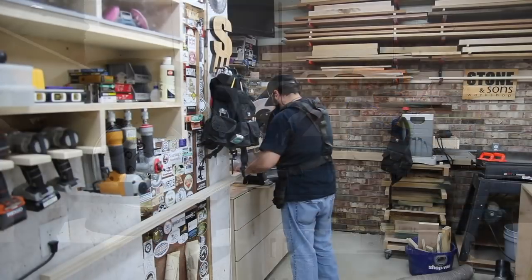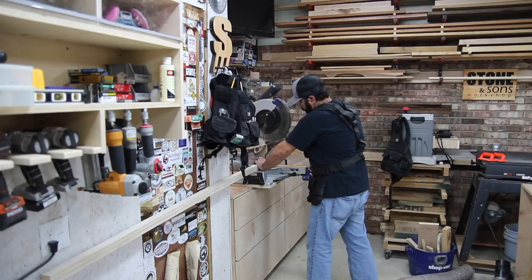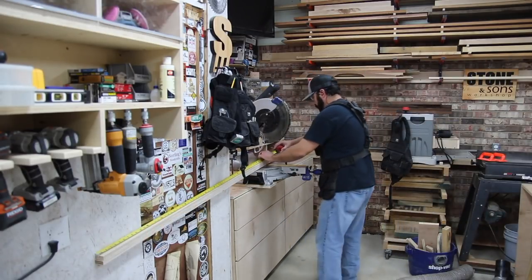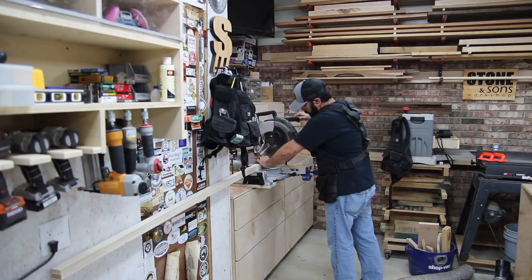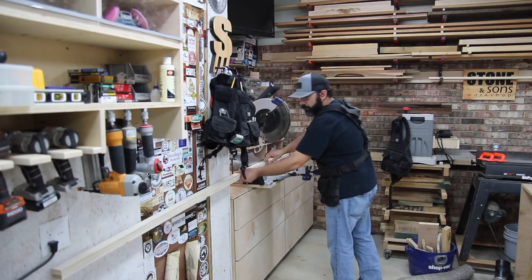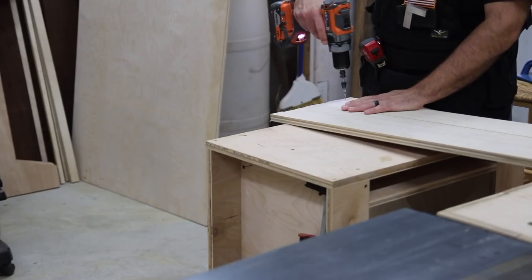You just have to let the blade do the work itself and guide it along the path. With this particular style, I'm making the four outside pieces — the two ends and the two sides — but there's going to be some internal parts to this as well. I'm cutting down, or have already cut down on the table saw, a bunch of strips of plywood and I'm just cutting them to length here. This is going to create an internal section of the bed underneath for support — kind of like where the slats are going to go.